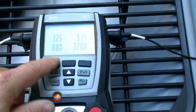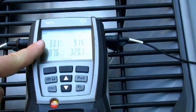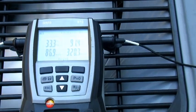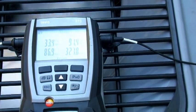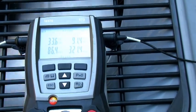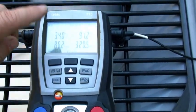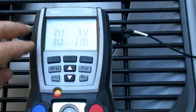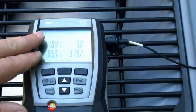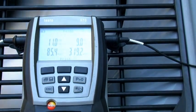The line temperatures are at 32 degrees. This is why, if you have low airflow, you're going to notice that everything's going to freeze up. Part of the job of an air conditioner is to remove humidity, and that moisture is going to run down your evaporator coil. If that coil is 32 degrees or colder, it's going to freeze. We need to keep it right around 40 degrees. Superheat is 10 degrees — this is a TXV system, it's always going to do what it can to maintain 10 degrees. Subcooling is right around 9 degrees.